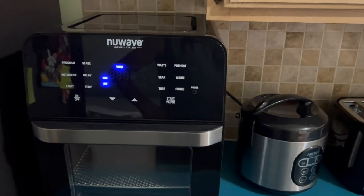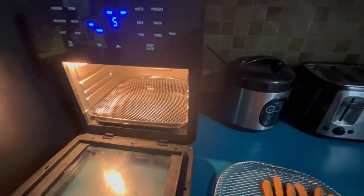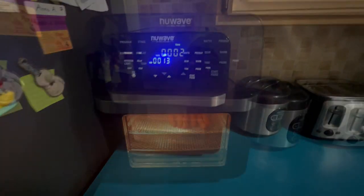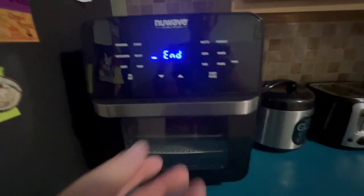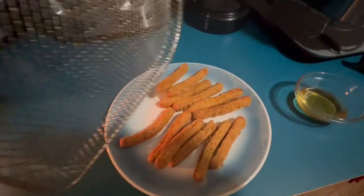Take two — after changing that breaker back to a regular breaker. It's okay — in go my chicken fries. Let's try that. At the end of the day, I connected that air fryer to two different arc fault circuit breakers and both tripped. So after changing it to a single-pole 20-amp slim, no problems. I'm actually cooking some chicken fries right now.